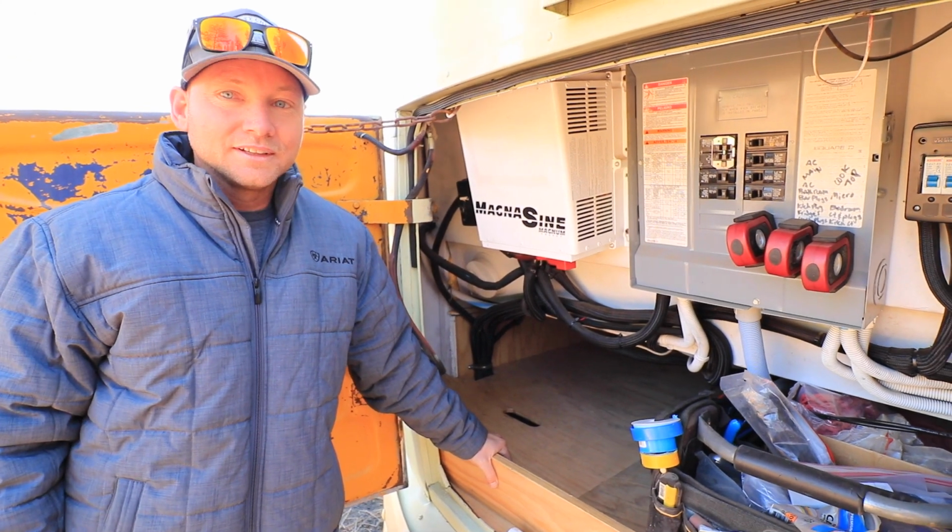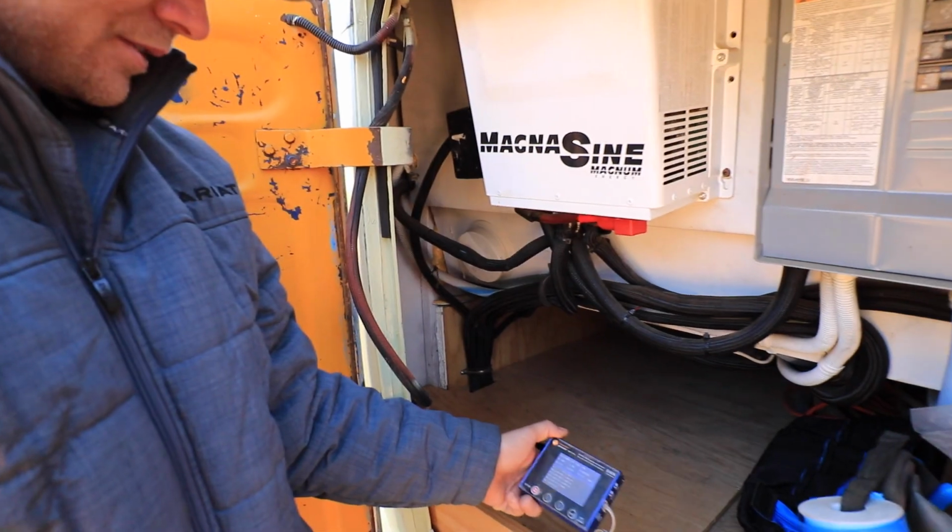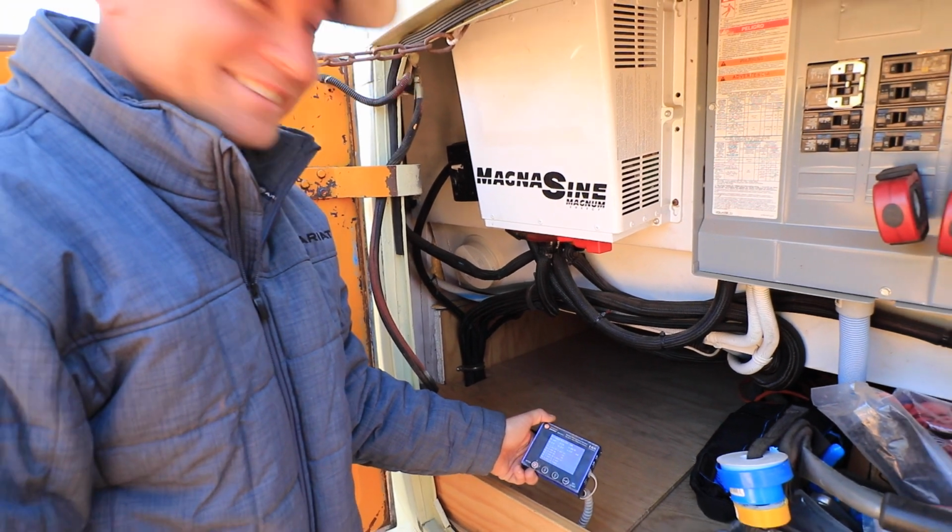So up on the roof, we actually have 3,200 watts of solar panels up there. That solar goes into our battery, which we rewired out of a Chevy Volt car battery. When we purchased the battery, it was 360 volts, and we had to break that down into 48 volt modules, and spent quite a bit of time and research how to get that thing to work. And it's actually a pretty large battery. It was very fun during the build, and it's definitely serving us well.